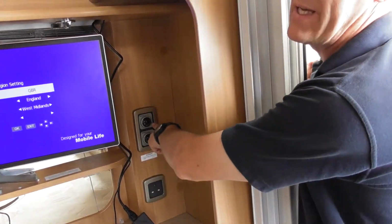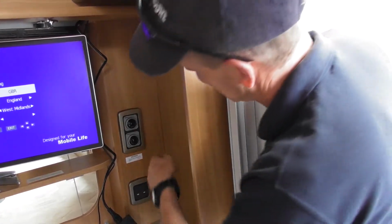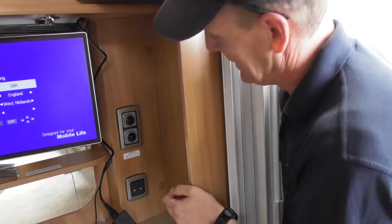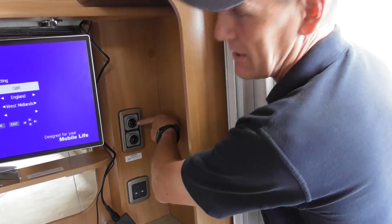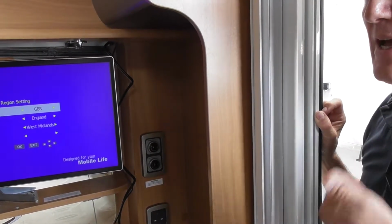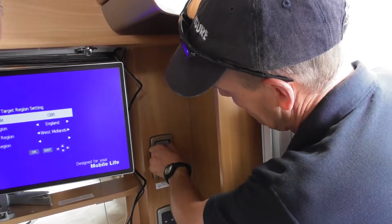Okay. And you can see there, it's got a little gas icon. So that is your water heating on gas. So to operate it, turn the outer ring, the grey ring. That clicks on. I don't think you can see, there's a nice little green light in there at the moment. Yeah. That's saying system's okay. If it goes to red, it's failed. Okay, so if it goes to red and fails, turn it off.